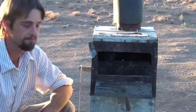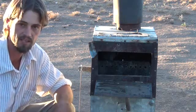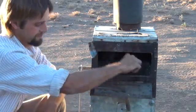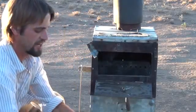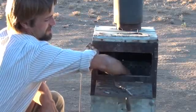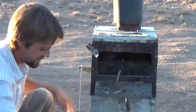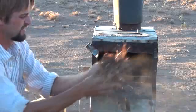Hi folks, Mr. Teslonian back here again. I'm going to go ahead and fire up the gasifying wood stove for you. First thing we're going to do here is load it with some fine materials that I picked up — some small sticks. You can use this with big wood or small wood; it's just easy for me to pick this up underneath the trees here. This is basically the firewood we're going to use. We're going to just feed that in the hole here. Make sure you don't have any long sticks sticking in there jamming it up at a weird angle. So we got a little bit of firewood put in there. Next thing we're going to do is take some of this cedar bark, just because I want a quick light up here. Just kind of feather it out a bit. Throw that in there.